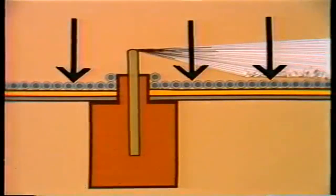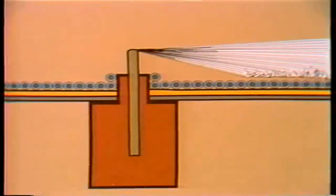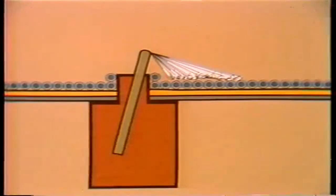Erosion is still a major concern here. Check the tubes around the soot blower openings for erosion that may be caused by steam or air coming from the soot blowers. If you find any, the soot blower may be improperly aligned, that is, blowing against rather than across the tubes. Now, if that has happened, both the soot blower alignment and the erosion must be corrected.